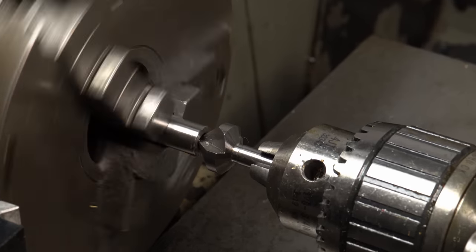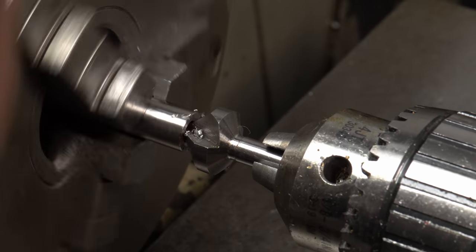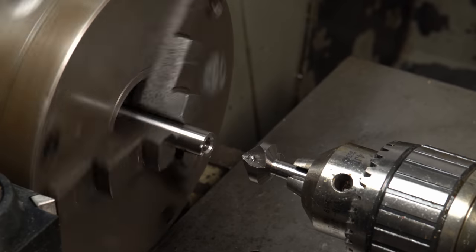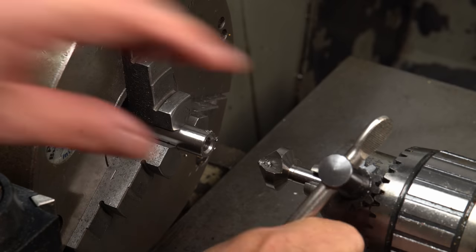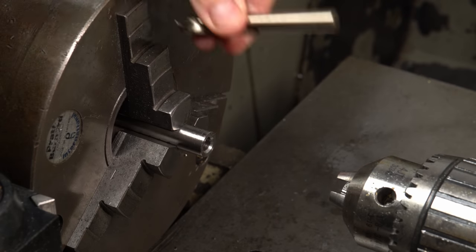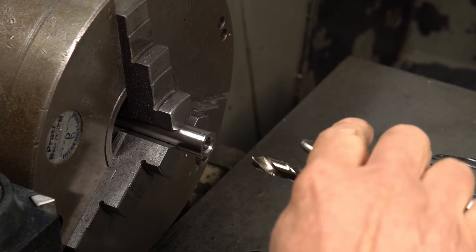Ask me how I know that cutting a gutter weakens the thread to the point where if it galls up when you tighten it because you didn't spot a stray chip, it'll snap the threaded spigot clean off. Yeah, it was all going so well. Luckily, it drilled out beautifully using a left-hand drill and some help from a blowtorch. I knew things were going too well, but I'm chalking that one up as a win. No damage done to the part, just another bite taken from my small remaining reserve of self-esteem.